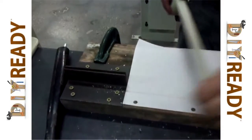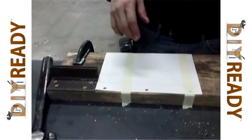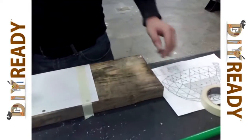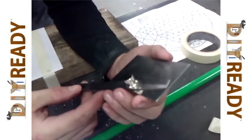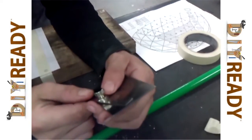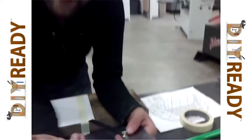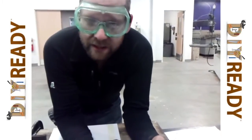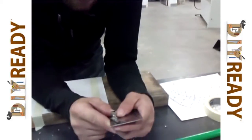First, we need to see how to find the angle. On your paperwork, it gives you the angle for each part. Right now we're doing green, and green is 8.47 degrees. This is an angle finder. You can use a protractor, or a cell phone app — there are some great apps that will find angles for you. We're going to turn this to the nearest degree, so let's call that 8. Because we're using metal conduit, this is one of the great things about it — it's very forgiving, it flexes. So we get to our nearest angle and nearest length and let the metal absorb the bend. We're going to turn this one to 8 — 5, 6, 7, and 8, right there.